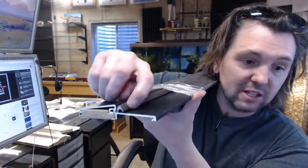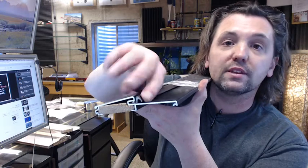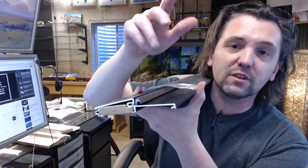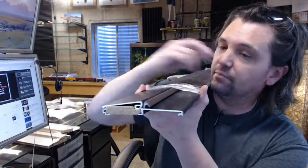The Q means that it has this insert — this bump-up style seal that the door makes contact with, which is commonly referred to as Q-LON. That is why they put the Q there. There is an image below this video showing everything important dimensionally about the threshold, and let's go over that now.